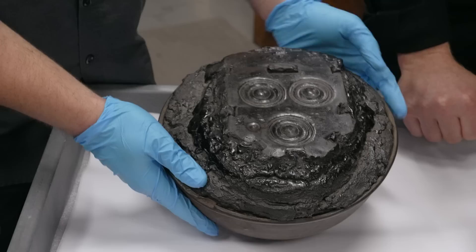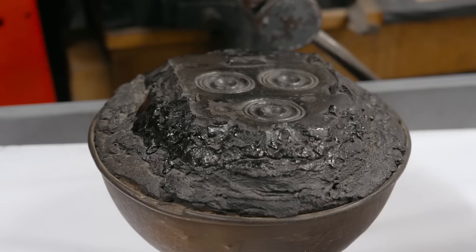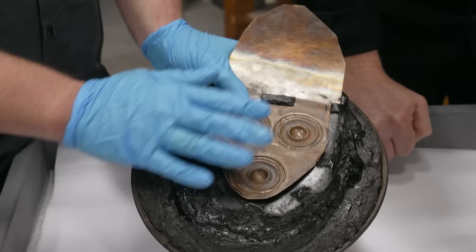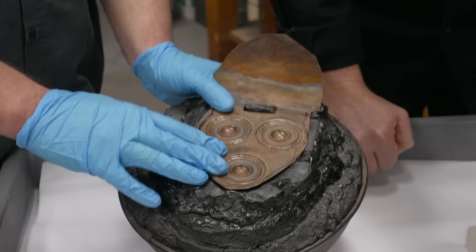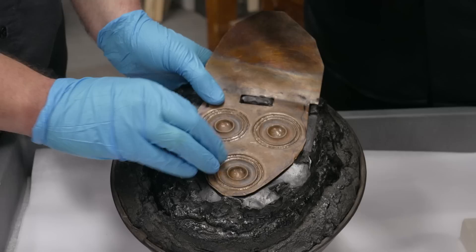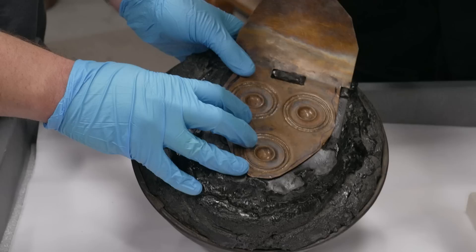What is pitch? Pitch is a pine resin, and it is a great substance because when you heat it up, you can actually sink a material into it. It will hold onto it real tight and resist blows. If you take a sheet of bronze, brass, copper, iron — anything like that — and just hit it in the center with a hammer, it doesn't really want to form a dome shape; it kind of wants to fold on you. So by sinking it into the pitch, it gives it the grip and the resistance to make these sort of big depressions. You're holding onto the whole thing and localizing the pressure, resisting the urge to fold and encouraging it to stretch directly under the blow.